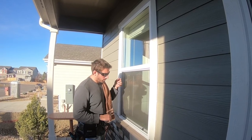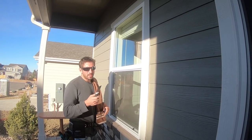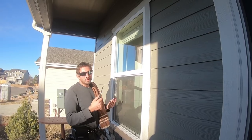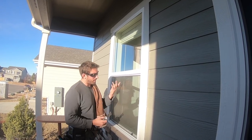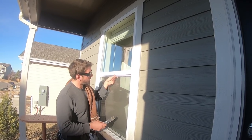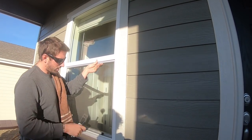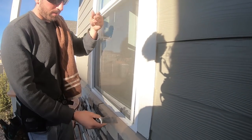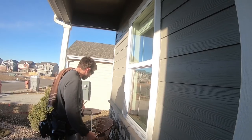The first thing you want to do when cleaning a double hung window is take the screen out. A putty knife is a great tool to remove the screen from the outside. If you're removing it from the inside, bring up the window, pull on the tabs and lightly push out. From the outside, lightly push your finger up in there — there are two springs that allow the screen to go up. Put the putty knife down and pop it out. That'll get your screen out. Choose whatever method you prefer.